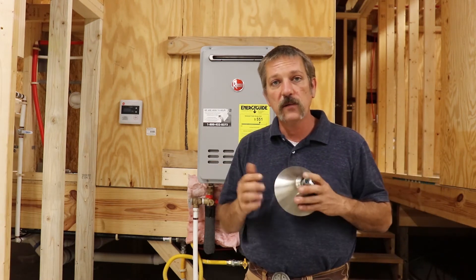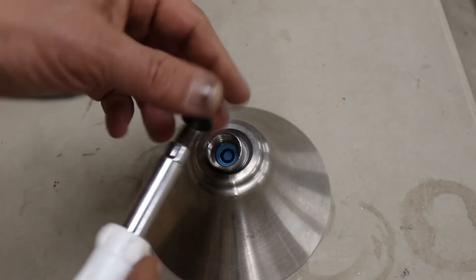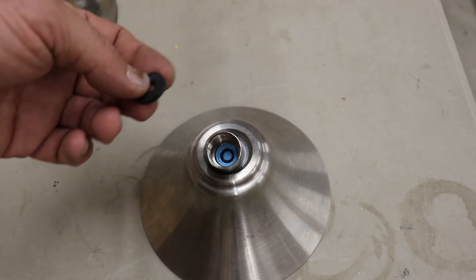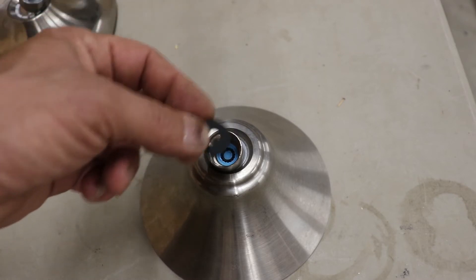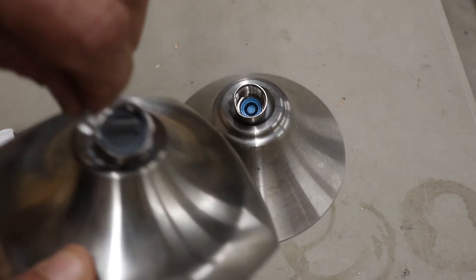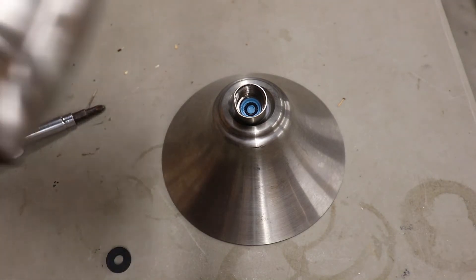Let's go to the table and zoom in close so I can show you how to pop one of these out. When you pull shower heads out of the package, most will have a little black washer in there — move that aside to get to your water saver. Hang on to that washer; don't throw it away. I used to discard them since we Teflon tape the shower arm anyway, but it doesn't hurt to leave it in as extra leak protection. On Delta models, there's a little gray filter tab thing that just unscrews — you'll want to save that too, as it works similarly.